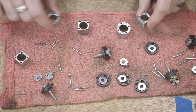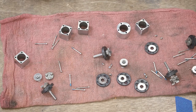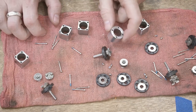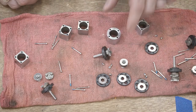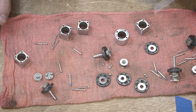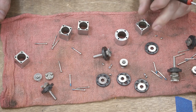In front of me I have several of these 22 millimeter gearboxes. They look a little something like this before I go and destroy them. You can see that the ring gear is one of the largest pieces and the only thing we can really shave any weight off of — everything else just kind of has to be what it is. This ring gear weighs about 25 grams, which in the beetle weight class is pretty significant, and we can see there's a lot of material around it — and this thing is steel. We just really don't need all this material.